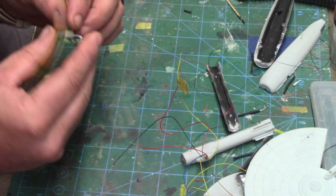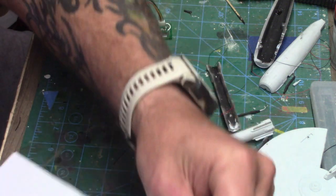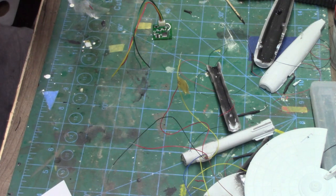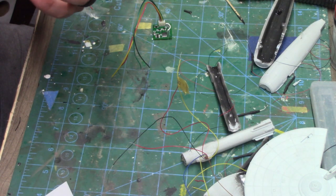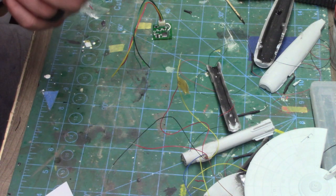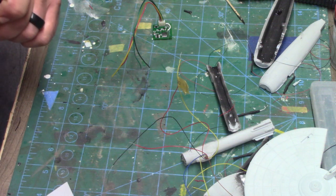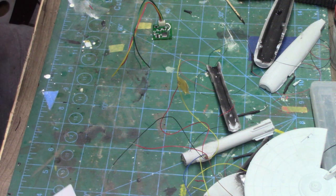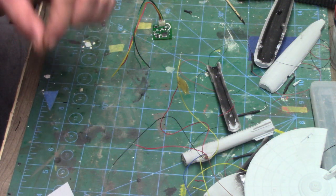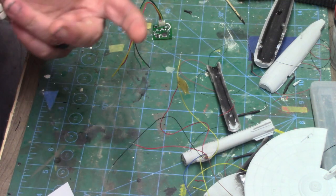But there is a thing with doing this board: you need to make sure the board is powered off. And yes, he gave me some great highlighted talking points. So, for board safety, in order to change the timing from one to another, you must have no power to the board. These programmable boards can only see the timing selected on the initial power up. So if you tried to undo that while it was powered up and then try to do another, one, you can short out the board.